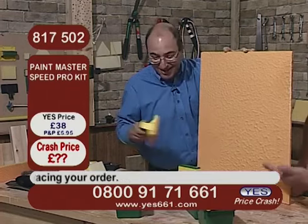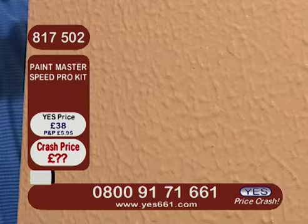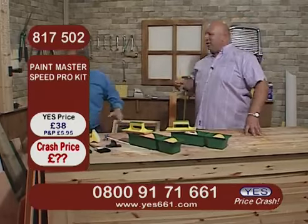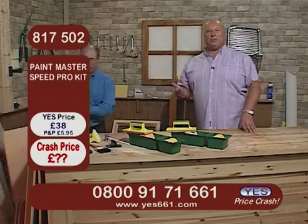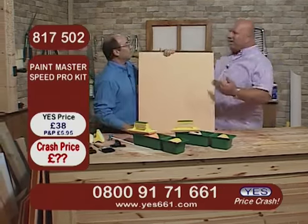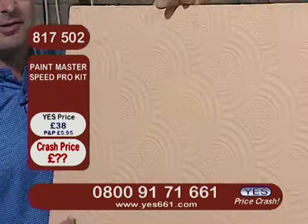I'm looking up nice and close here and I can't see a patch. If I'm decorating, I swear by these pads, by the way. But before I used the pads, I actually used a brush. And if I got back up the next morning, I'd always see little patches of the old paintwork because it never got into something like the blown vinyls. Here's a wallpaper-type finish again, and you can see a bumpy finish.